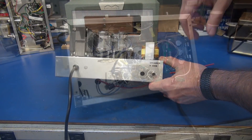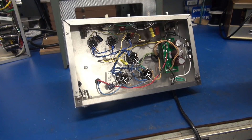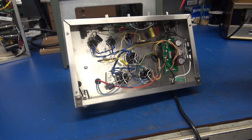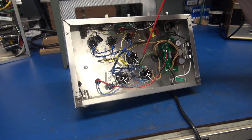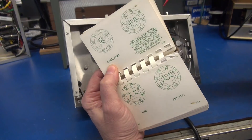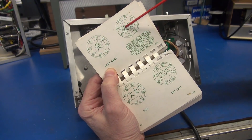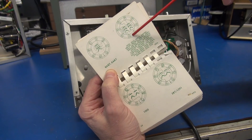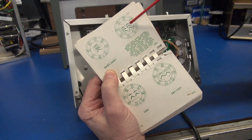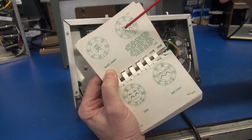Now for the fun part — let's go bottom side. Here's the bottom side tour of the D-Lab new concept 6SN7 tube amplifier. I've been reading on the web and a lot of people have been saying they want to build an amp using 6SN7s as the output tubes. So here it is. You can see I have three octal tube bases, with little jumper wires going between elements. A 6SN7 actually has two triodes per tube, so I ran jumpers from the cathodes, the plates, and the grids and turned each of those tubes into one triode.